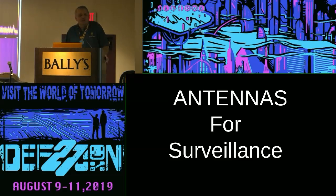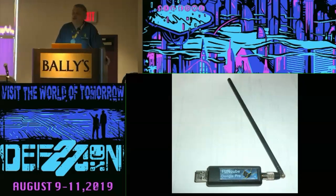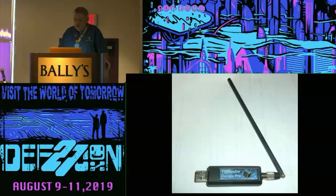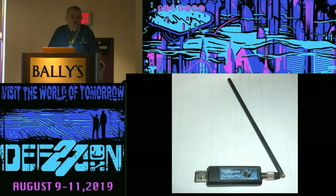We're going to talk about some of the antennas that you can use with your various receivers and software defined radios. There are some real problems with the SDRs, though there are some pretty good ones out there. The FunCube ones happen to be one of the few that actually have filters built in. You stick a little whip antenna on it and it's good for listening to transmitters that are 10, 20, 30 feet away. But if you're trying to do some really serious work — talking kilometers and miles — you're going to need something a lot better.